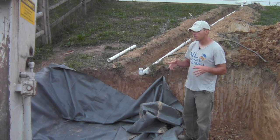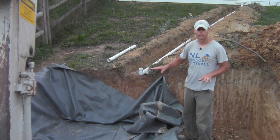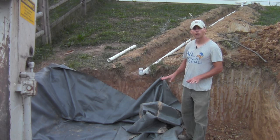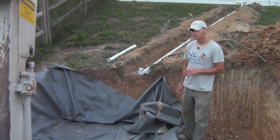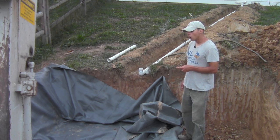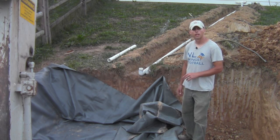We can also get more volume of water in at 24 inches. The issue is this area of ground was not completely level — there was about an eight-inch difference between the high and the low. We thought we'd level the bottom and fill in extra gravel to make up the difference, but that means one corner ends up with 24 inches of gravel and the other side ends up with 32 inches, which is a bit of a problem. So tomorrow we'll take some soil and fill it back in to get 18 inches at the lowest point and 24 inches at the deepest.